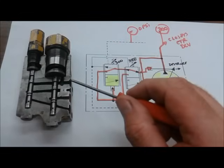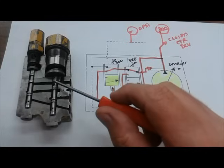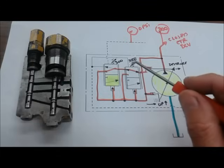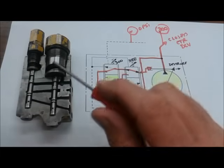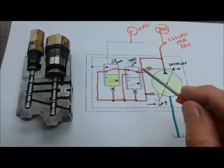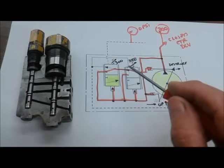And again, the third connection on the pump here is to the case of the pump for case drain. And it drains the spring chamber of the pressure limiting compensator just so that spring doesn't get hydraulically locked. And it's also going to provide the drain come time for upstroke when we get a load sense signal and the load sense spool has to move back down.